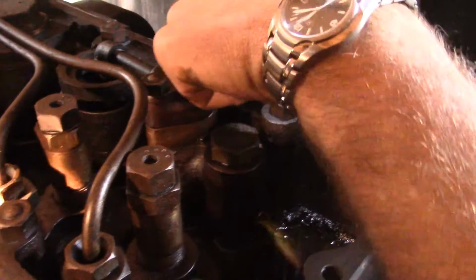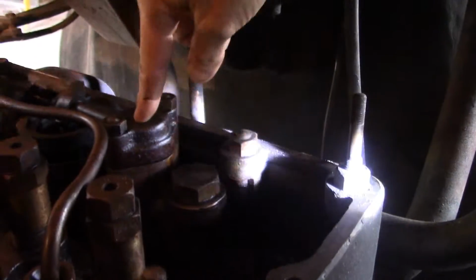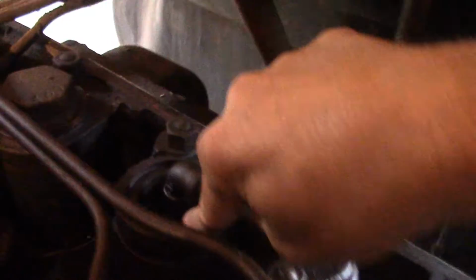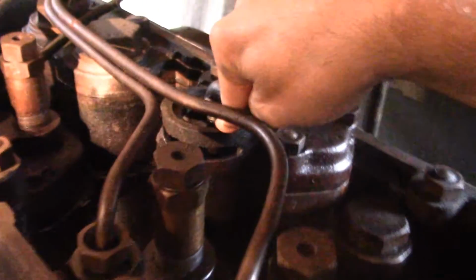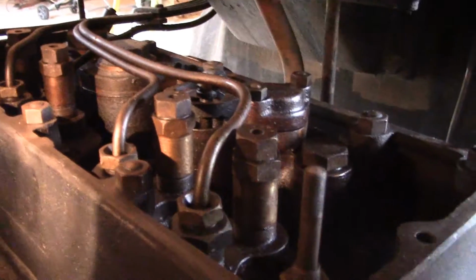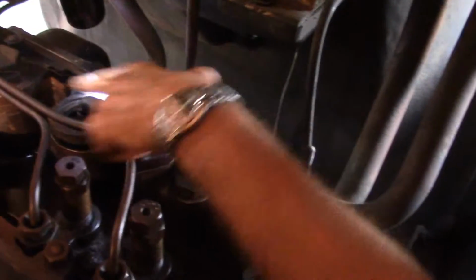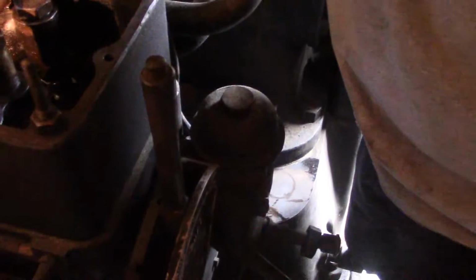So it's like a lift pump, you mean? Yeah, it's a piston pump, it goes up and down under here. But the discharge is here. It comes over and dumps it in there. If you didn't have an external filter, which was one of the many options they had, a little drop-in screen would go here, but you'd have to pull that off to change the screen. And then when it's pumping, it's continuously pumping, filling this, overflowing the overflow, and going back to tank.